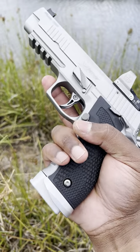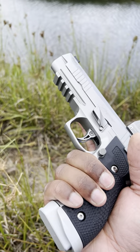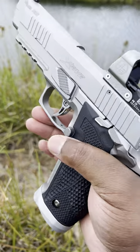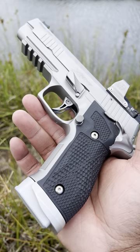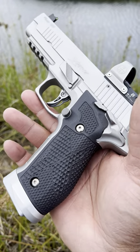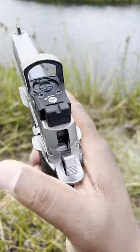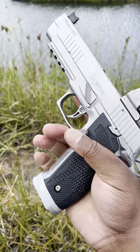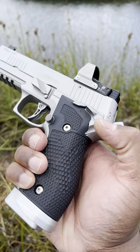So I blasted it with — I think it was 60 to 80 grit glass beads — and gave it the finish all over all the parts. Then I put a Cerakote H301, the matte clear coat, over the entire gun and the hood of the Delta Point. I just wanted it all to match and then give it a clear coat to protect it so that they don't rust.